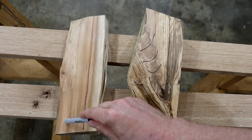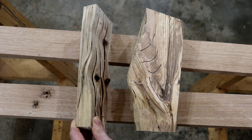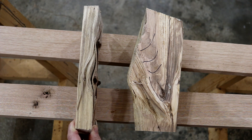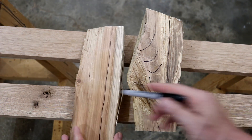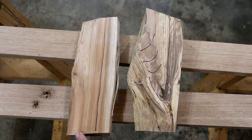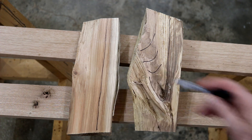As I touch this, see how that wiggles? Because this came off a wood splitter. When something comes off the wood splitter, it is going to go the direction of the grain every time. The straighter the grain, the better the wood. You can even see here how this one has a wave to it as it came off. If you want to build really nice furniture, find yourself the straightest grain wood you can, split it by hand, and then do very minimal joining, planing, or shaving.